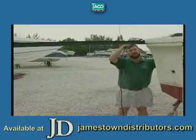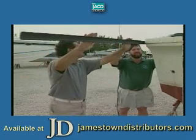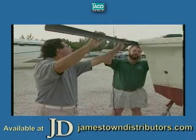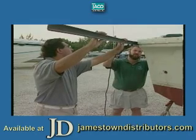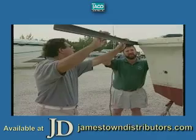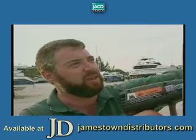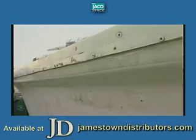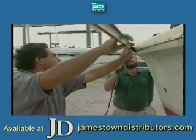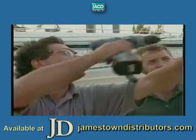I think it's about ready. You can also do this with a hair dryer — it's going to take a little longer, but it'll get the same job done. You want to be patient here. You don't want to force the rigid vinyl around the corner, otherwise you're going to get some white marks. You want to keep it looking real pretty. And when you're using a heat gun, don't put your hand too close because you could burn it. Once it's come around, we're going to tack a few screws in on the other side to hold it in place.